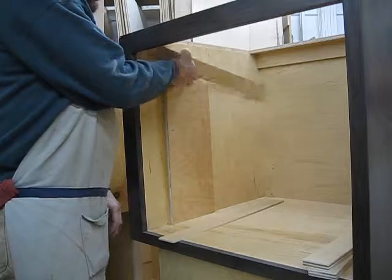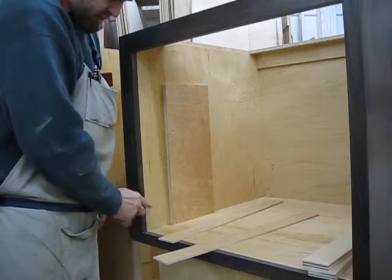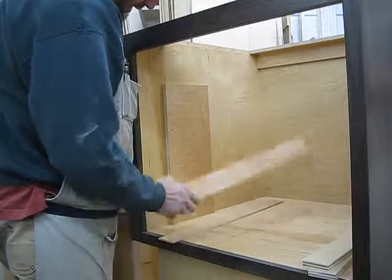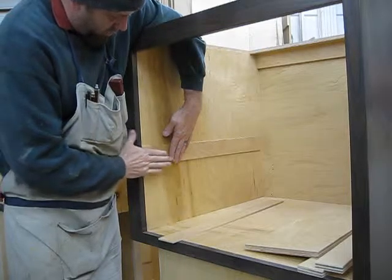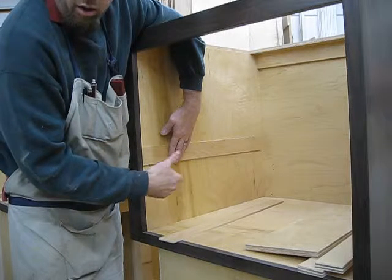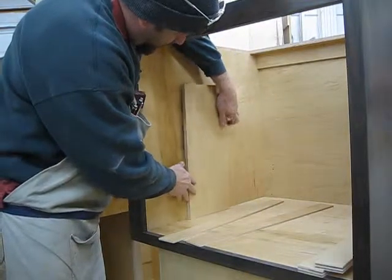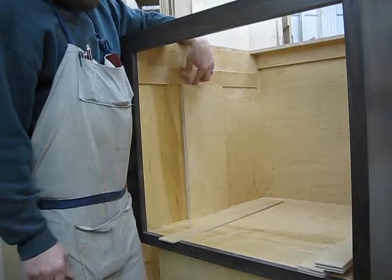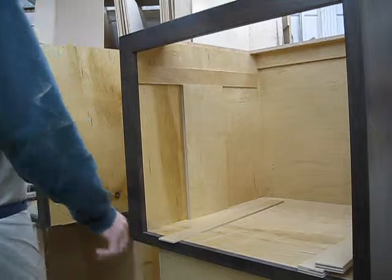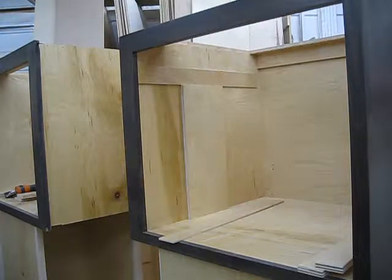In this cabinet I'm going to be putting my side mounts on. There's a lip here on both sides and I have to fill that lip with something flush so that the hardware sits evenly, otherwise it won't work. I've already calculated the spacing — this is just a spacer. The bottom of my hardware is going to be sitting on this piece, and then there's my other spacer which I have now misplaced.